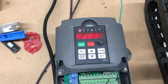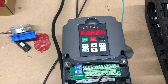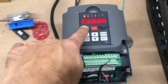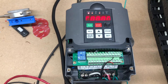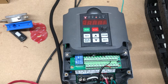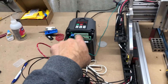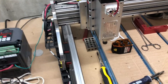If you let it time out, it'll go back to the main screen. One last thing: if you're going to run this off PWM — pulse width modulation — which gets the spindle to interact with your toolpath, you have to make sure before you run the toolpath that you hit the run button so it's solid. Then when you hit the toolpath, it'll come on and show you the RPMs. When you're not using it, hit stop and it'll flash. If it's flashing, it's not on and not armed. If it's solid, it's armed. When I use the laser, I make sure it's flashing.